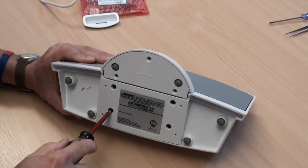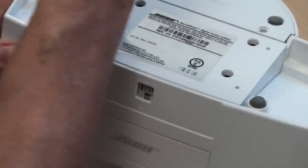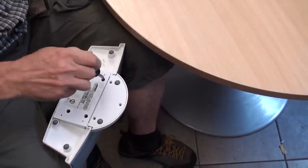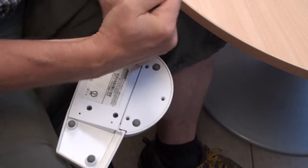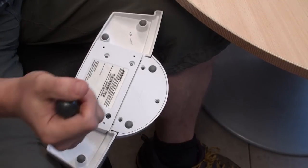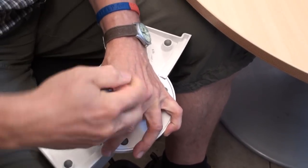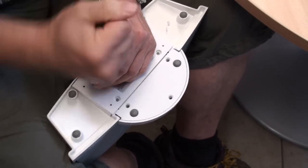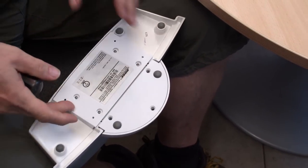Cutting to the dock: Type A dock, charging your iPod, connector looks good — then it's probably the sound processor causing the problem. Remove the four screws in the base — they can be very tight on some units, so make sure you have a good screwdriver. Some have been assembled at the factory with larger screws than intended. Remove the four screws and the cover lifts off, revealing the sound processor.